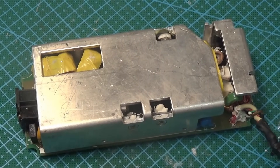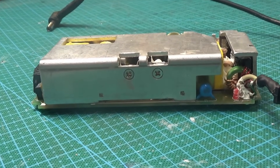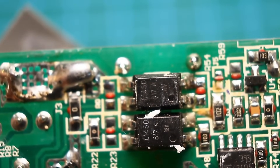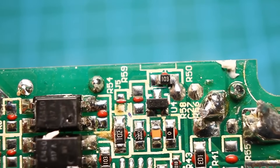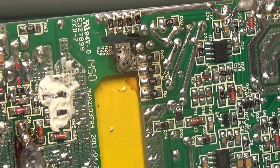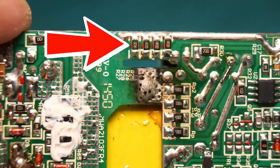Current stabilization — where in case of problems the unit doesn't shut down but goes into a limiting mode delivering maximum current — can completely destroy an already burnt-out laptop. The second optocoupler is used for voltage feedback and stabilization. The voltage is set by a TL431 — a controllable Zener diode or reference voltage source — and the output voltage can be adjusted by selecting two resistors. There is also current protection; the current sensor consists of low-ohm SMD resistors in the source circuit of the high-voltage MOSFET.